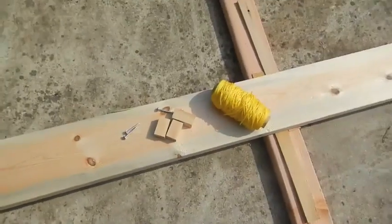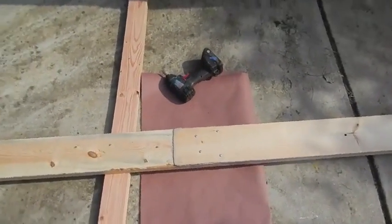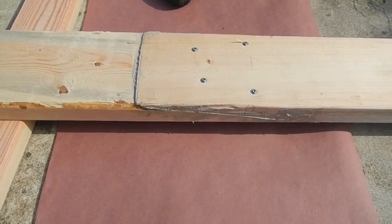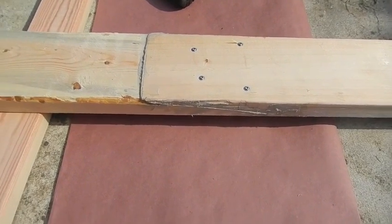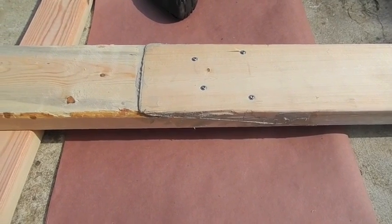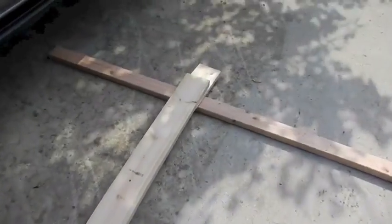Keelson laid out. There's the scarf joint — not beautiful, but it doesn't matter. That's the whole thing with stitch-and-glue boat building: don't make the panels perfect, because it's better to glue them up. So I'm taking that principle here. PL Premium — this is actually the fast cure; I've never used it. We'll see how that works out. I can see it's already working, starting to swell out.